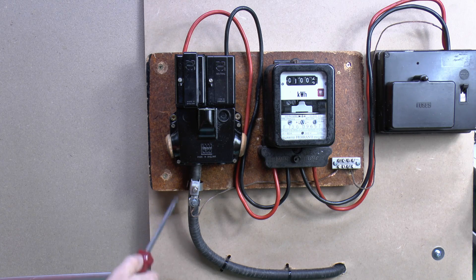Now the problem with these cables is that the older ones are a lead and paper type - basically two conductors inside, with a paper wrap for insulation, and then a lead covering over the outside which is used as the earth. Over the top there's usually a steel banding and then some sort of hessian and possibly some tar. Don't ever be tempted to try and move these, or just pry them away from the wall, because a lot of these cables are decades old. If you're attempting to move this, there's a fairly good chance of the cable becoming damaged internally and shorting out either between line and neutral, or between line and the outer casing which is the earth. What's on the end of this is probably going to be a 400-amp fuse in some cases, maybe an 800-amp fuse in other cases, or maybe no fuse at all if it's been replaced with solid links because the demand in the area has increased.